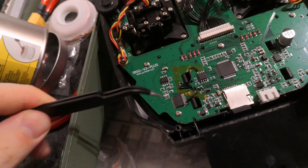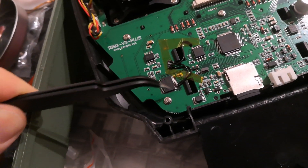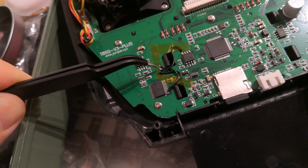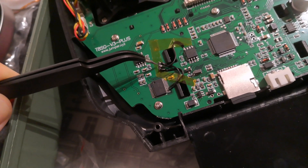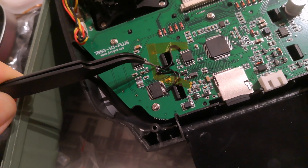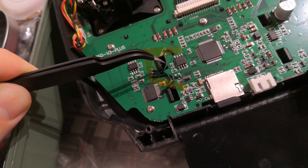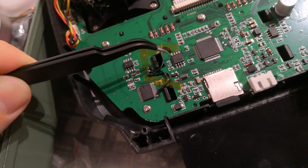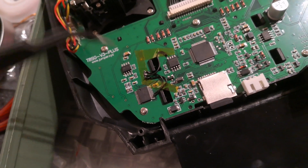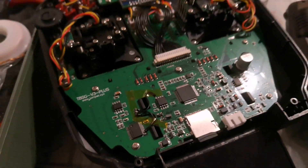So this is how the fix looks. There are two wires connected to pins 14 and 15 of the MP3 decoder chip, going to a set of two 22K resistors soldered in the middle. This is glued on top of Kapton tape to not destroy anything in the controller. The wire goes to pin 8 of that chip, which is 3.3 volts. I'm going to cover everything with liquid electrical tape to make it resilient to vibrations. And that's the fix.